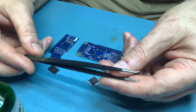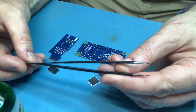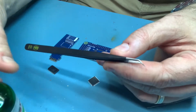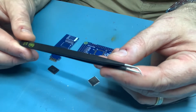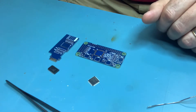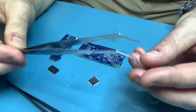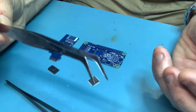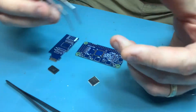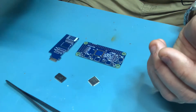The other thing you need is some really good quality tweezers. These ones — I think from Digikey or RS — are Edson brand, apparently made in Germany, really great quality. Cheap tweezers are exactly that — cheap. They cost a couple of dollars; it's worth spending 20 or 30 Australian dollars on decent ones. Cheap ones are crap for desoldering and picking things up accurately.